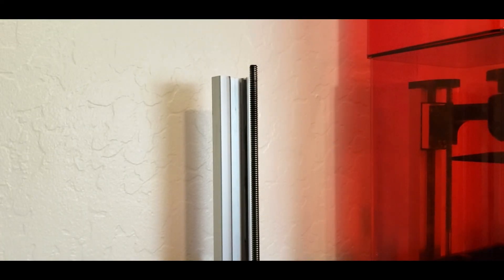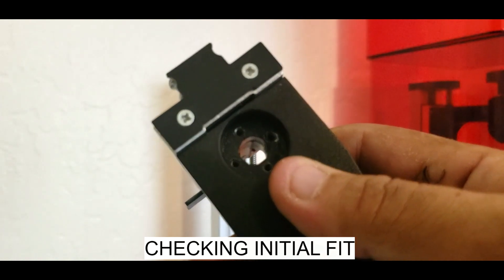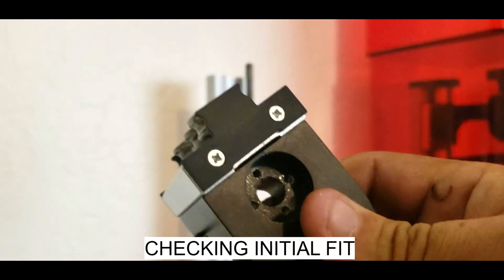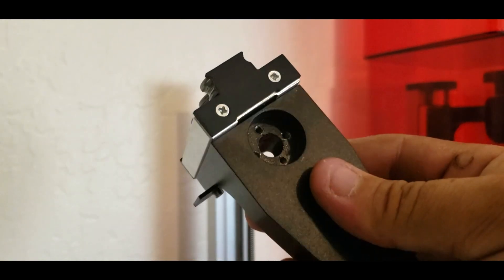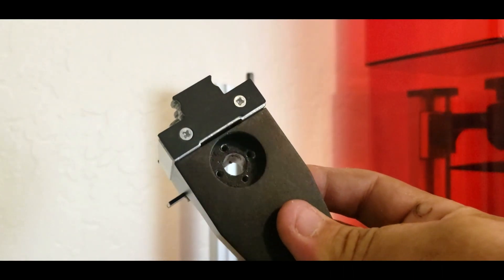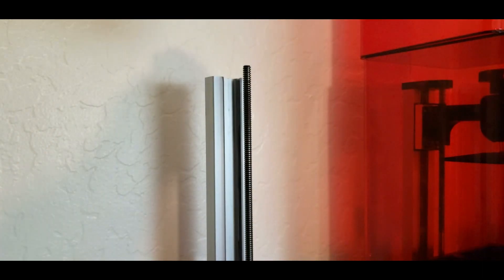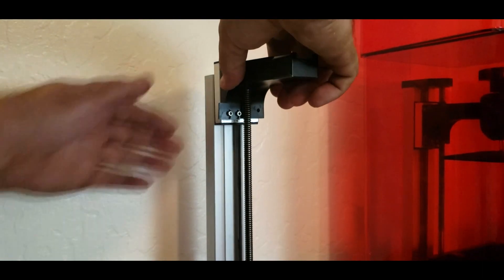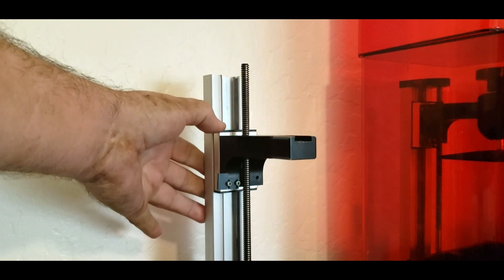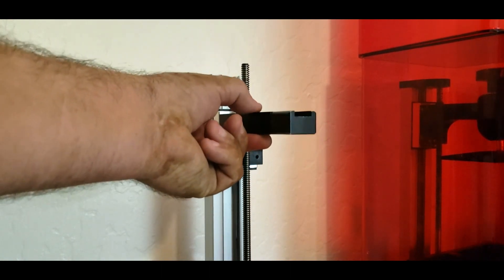Now this carriage is off and I've gone ahead and removed the nut inside. I want to show just how tight these are from the factory — and what this does is it actually affects some of the z-banding issues that some people have been seeing. For those of you who have pulled these off before to get the stepper motor out, you've noticed when putting them back on that they are super tight. This is a bearing assembly — this arm should run smooth and drop under its own weight, but it does not.